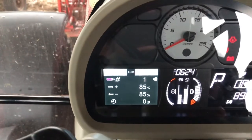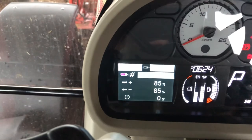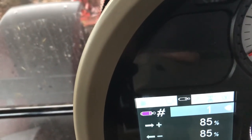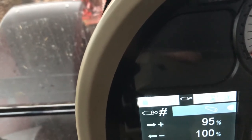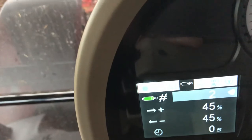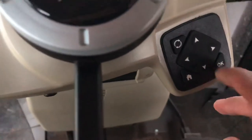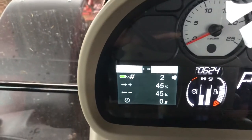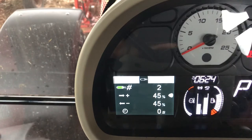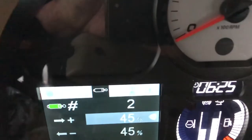If you want to go to a different spool, if you press that again and press down, you'll see: pressing the arrow down — that's for your front linkage, that's for your front linkage spool one. And if you go again, that's rear spool green two, and that's pumping 45% and 45%. Then if you press OK, that's now locked on spool two.